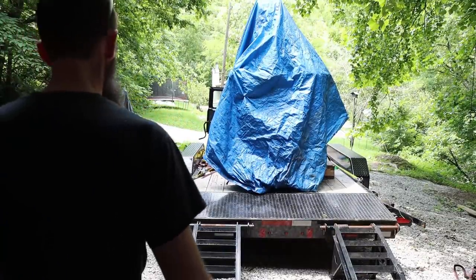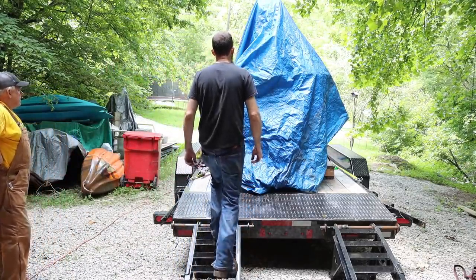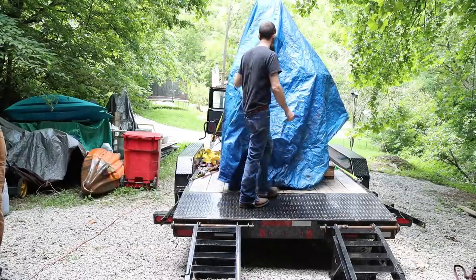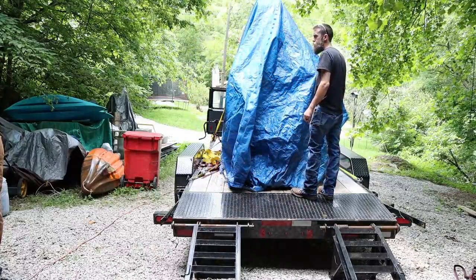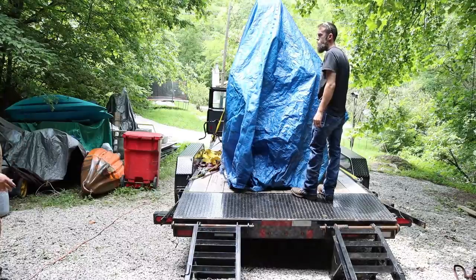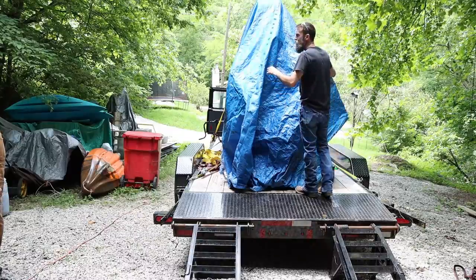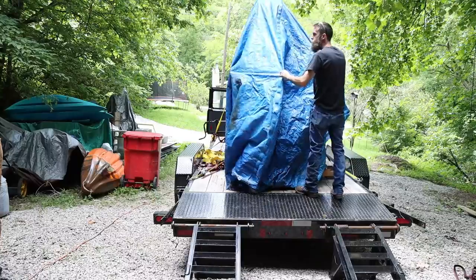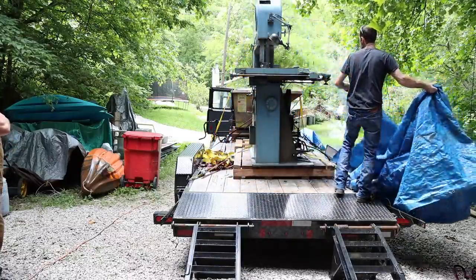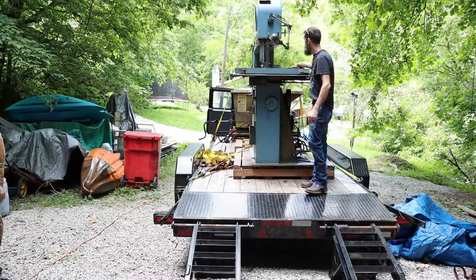Talk about enlightening. Yeah, it's a shame that stuff was so cheap. First of all, it's got the plastic wire loom that they put around all the wires, and it goes through a hole in the box. The plastic wire loom can't seal anything. No. And what do they expect at the back end of a vehicle, in Minnesota, in the winter? Are you insane? God, we're lucky if they last 5 years.